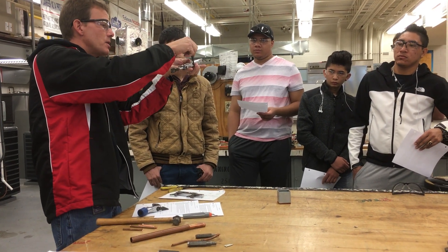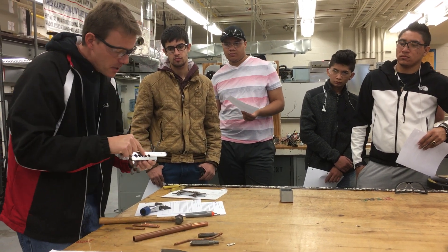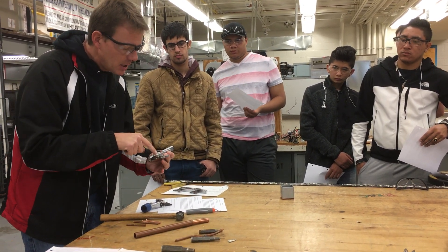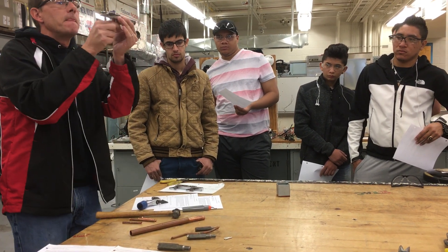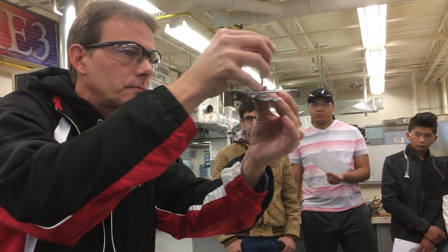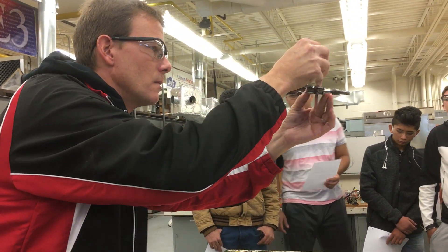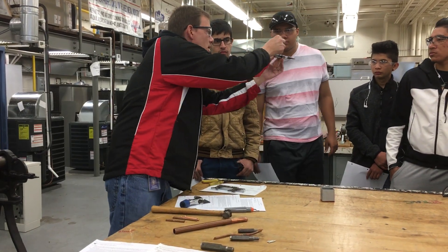That's a little harder to line up. You're going to have the side with the bevel, so most of the time you should be looking at the numbers on the flare block and just line it up right there. That's the height. Now, because I did the cut really quick, my swage punch won't fit inside.